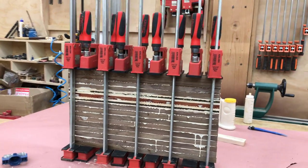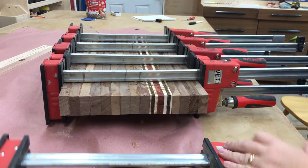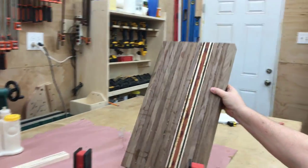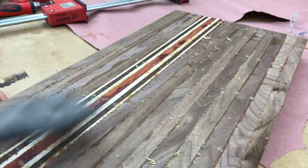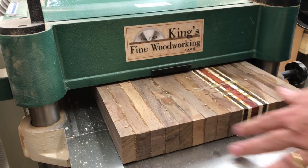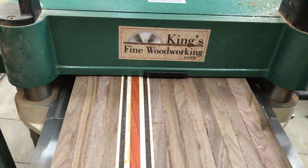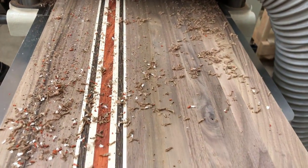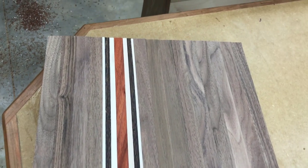In addition to lots of glue, I like to use lots of clamps. It's very important to squeeze all of the excess glue out — that gives you the highest strength. I don't usually bother trying to clean the glue off during big glue-ups like this. I just wait until it's all dried, then use a paint scraper to scrape the bulk of the glue off, because a couple of light passes in the planer will take it off fully. Using a planer also means I don't have to be so concerned if the boards aren't all the exact same height. If you don't have a planer, get the boards as flat as you can during glue-up so that all you'll need to do is sand the surface.